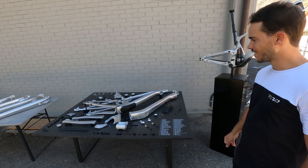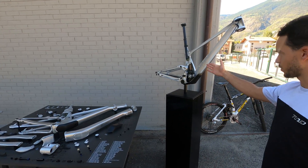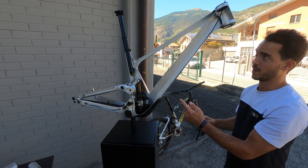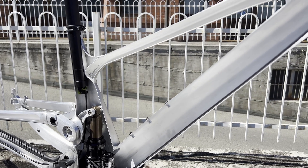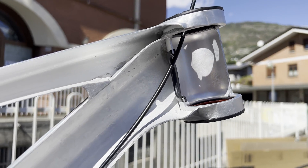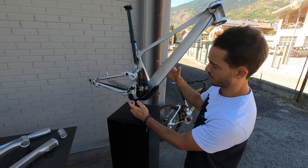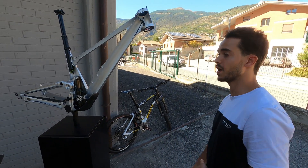It's still not just an off-the-shelf job, that's for sure. Here we have a nice cut frame — it's quite a cool one. You can really see all the optimization we're doing. I haven't talked about the butting yet, but you can see it really well here. It's triple butting, so we have three different wall thicknesses. You can see it's quite thick near the head tube where we need rigidity and strength, and in the middle where it's not so critical we save material to reduce weight. We go much thinner there than in the structural areas near the BB or the headset.